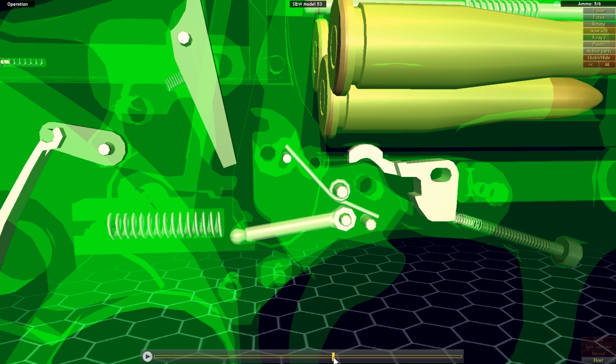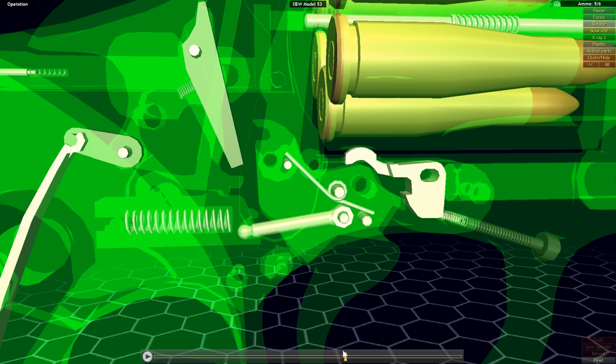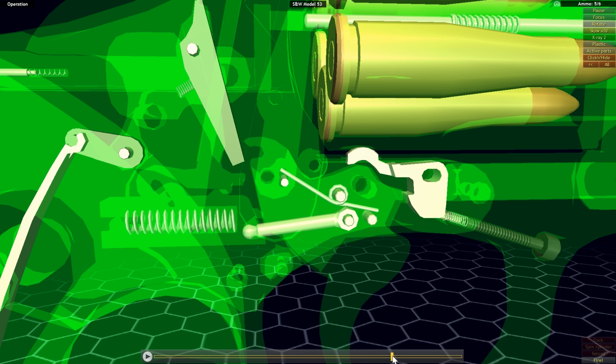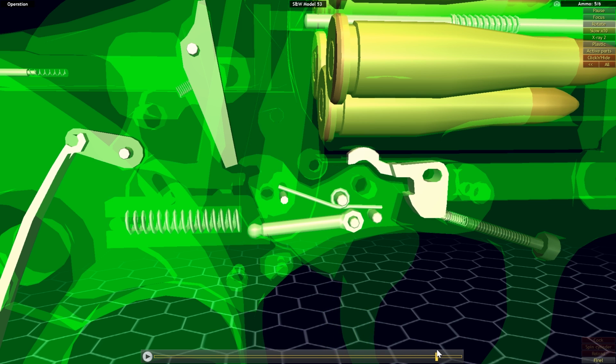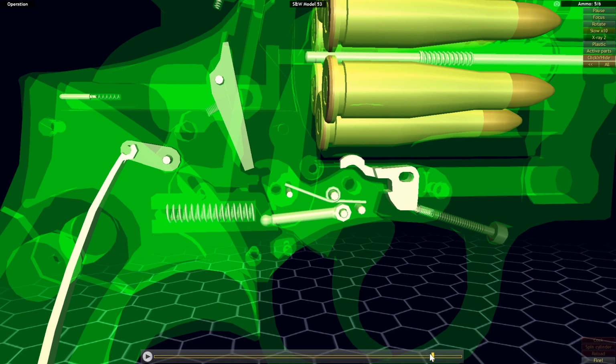So as the hand comes down and contacts the ratchet tooth, because it gets pushed back a little bit, this spring is going to get compressed. But once the hand is beyond the ratchet tooth and starting to be driven inward, this spring will push down on the hand to make sure that it pivots in underneath that ratchet tooth. So that's how that works.